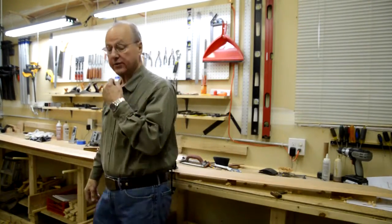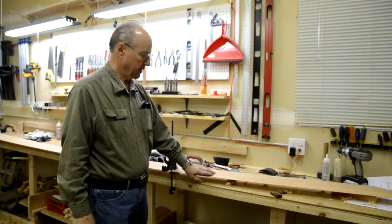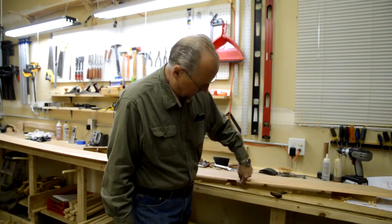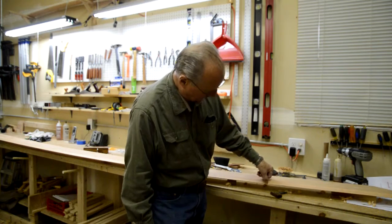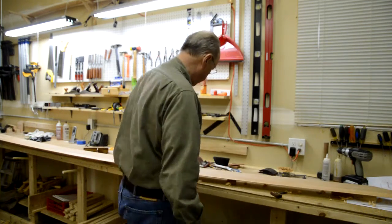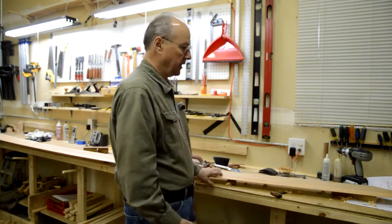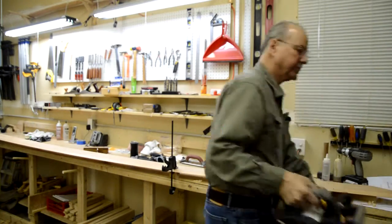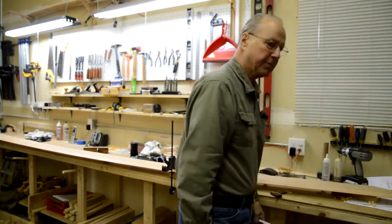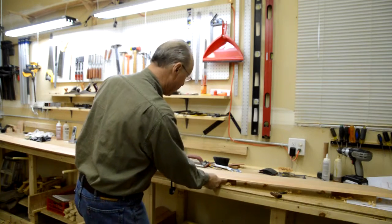This is Sunday the 26th and I'm just finishing up the lower bevel — the one and one-eighth inch bevel. As you can see, this surface right down here is still an eighth of an inch thick. What I do is take my little tool and draw a pencil line down the edge of the board, and I use my hand tools which take about 80% of the wood off the bevel for me. I also draw a line down here to make sure I don't get carried away on the lower edge.